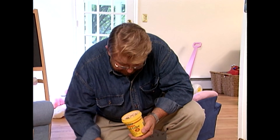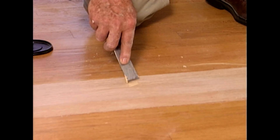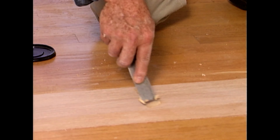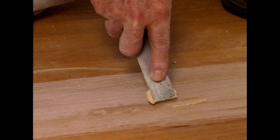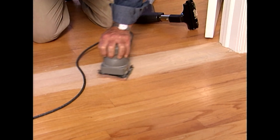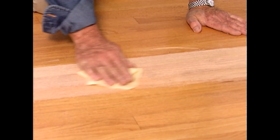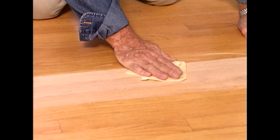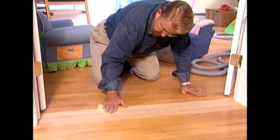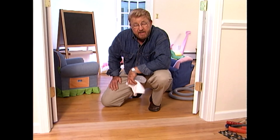Next I take some wood filler and fill nail holes and small gaps. My technique is to put in enough to slightly overfill the crack or hole — not much more, because excess just means more to sand off. I use a vibrating palm sander with 100-grit paper for the final smoothing. Then it's time to remove any dust — first with a vacuum, then with a sticky tack cloth made just for this purpose.